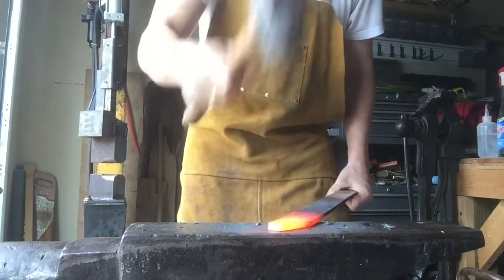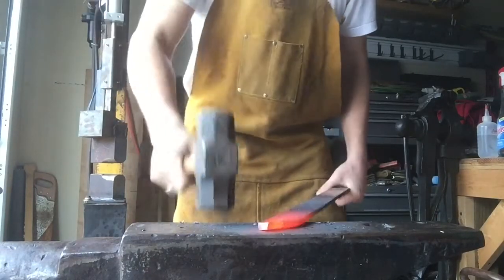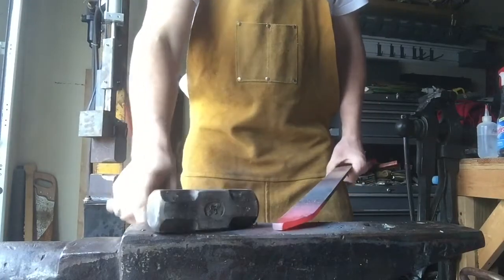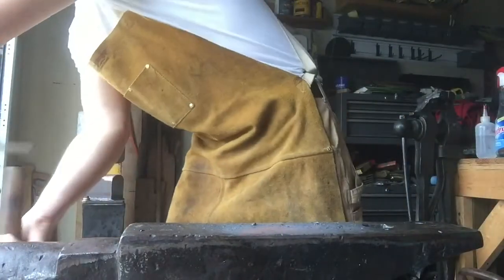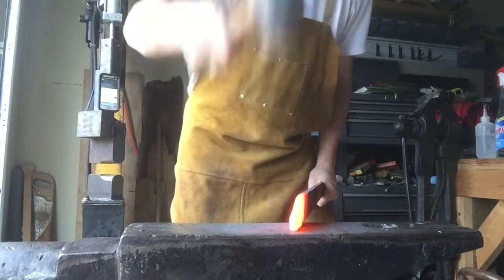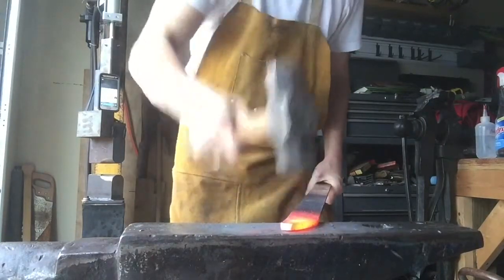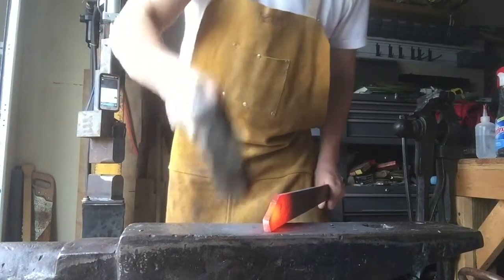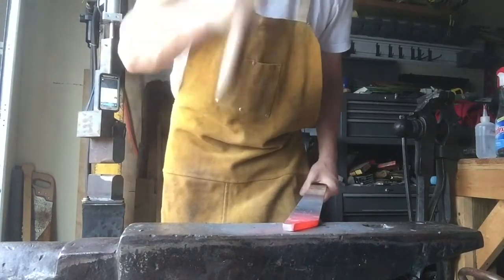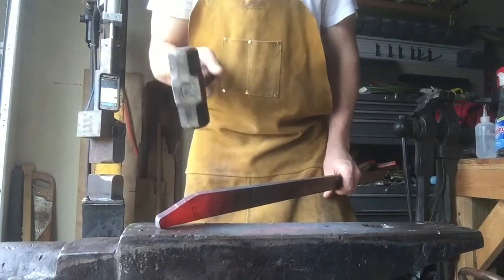It's got a long taper on it. It goes from fat all the way down to a nice point. That's that French style chef. So this is going to be a lot of hammering. Go back up to the top, start working that down a little more. A little bit better transition. And back to the point. Keep working it all so they don't get such a dramatic dive, and we get more of a smooth slope, not a chisel point.